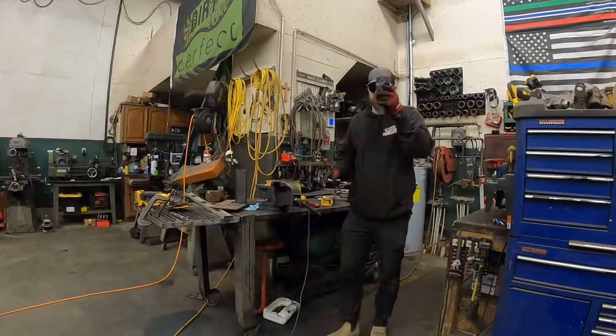All right, I've been down this road before, and I know what happens. So, if we take his bolt and just hold a nut on the other side... Very smart thinking, by the way. I am very impressed with you. And just hold a nut on the other side, we'll keep it centered in the hole, but it'll draw. So, I'm thinking we double nut it, like so. That should keep it true in the hole, shouldn't it? Yeah. So if you tighten that down. And you know what the best part is? You don't get the option to burn my fingers. It's on itself. So, you like that?